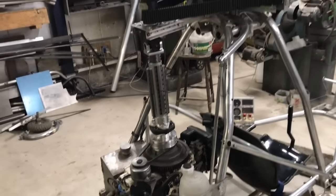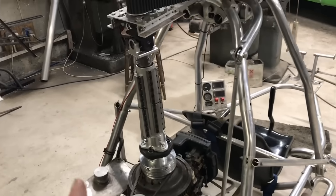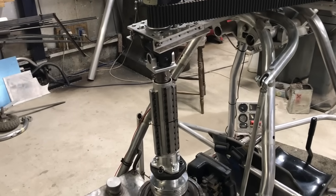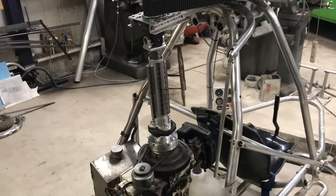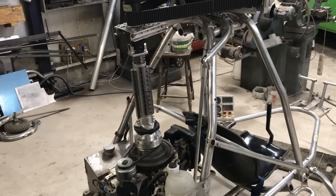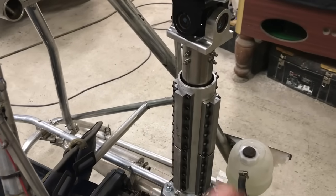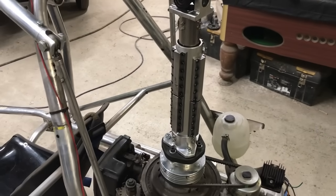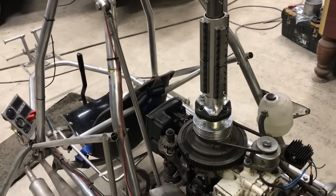I am finally ready for a test — it's been a long time so I'm a little nervous. The purpose of this test is to find out whether there's too much vibration in this sliding action and if it binds up with centripetal forces pushing the bearing against the outside of the slot. I'm not intending to run it at full RPM, and I'm half expecting not to get to full RPM. If the vibration is too high I'll cut it off way before that. I've tested just one of these screws at over 300 kilograms, so we have 12 of those holding on the guide — I don't think there's any chance of one coming off, but I'll be wearing a helmet just in case.